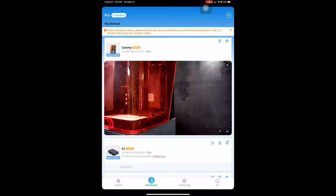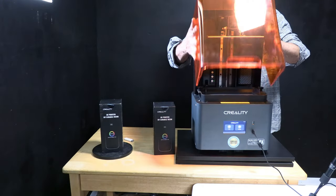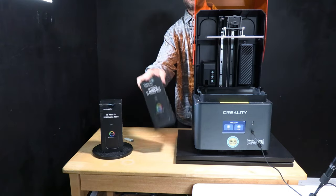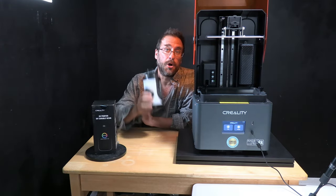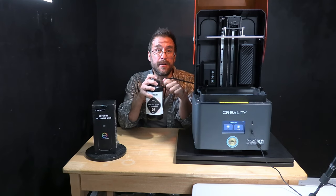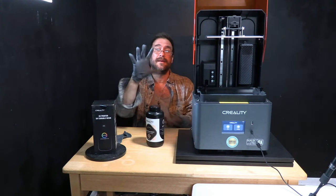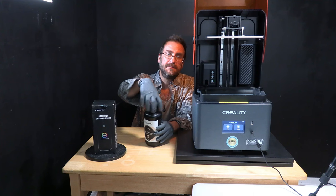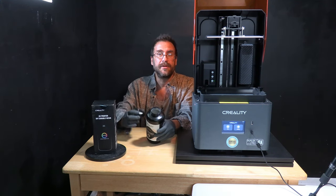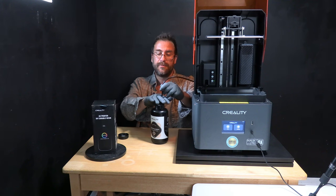Now that we see our camera is working, let's go ahead and fill the printer with resin using the super cool all-new resin feed system. We are going to pop open the cover of our Mage Pro and open up our box of resin. With traditional resin printers, you would open this bottle up and pour it manually into the vat. However, with the Mage Pro's automatic resin feed system, we are going to insert this tube into the bottle and feed it using the pump. Before using your resin, shake it well. When you handle resin, it is recommended that you wear gloves. Open up the bottle and you will see, to my great disappointment, that there is no protective film whatsoever on the bottle. This is disappointing because it means the bottle will be open with the tube inside to feed the printer.